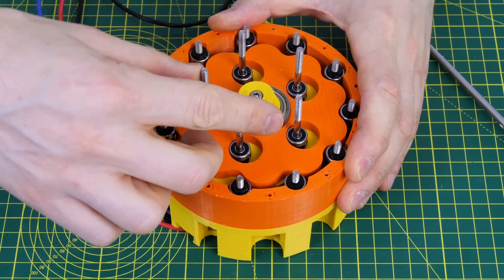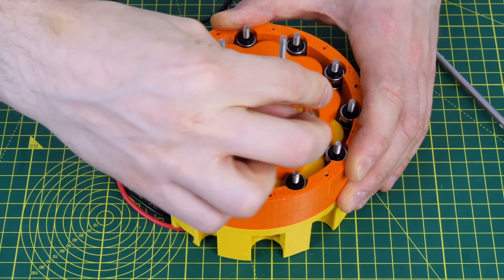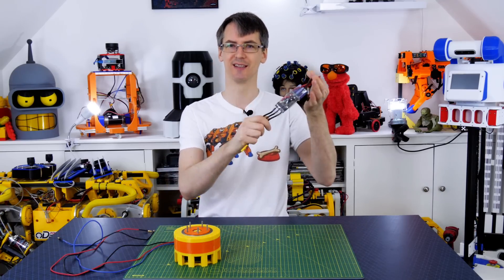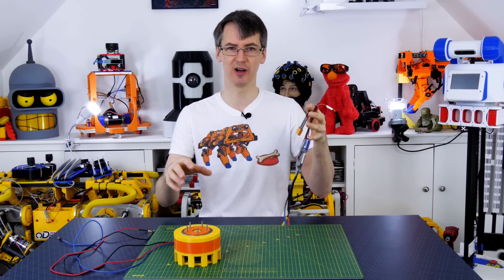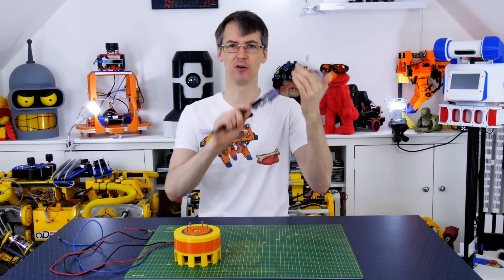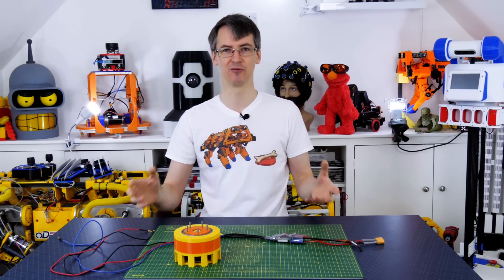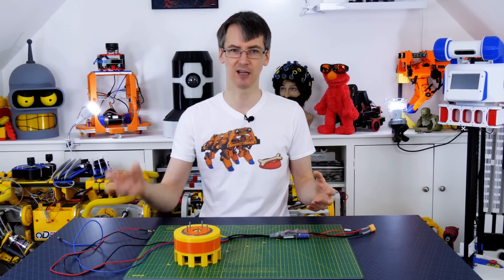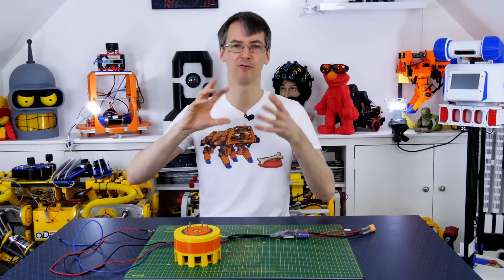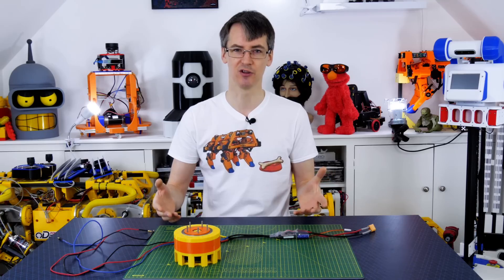I thought I should check inside to check there haven't been any issues, and everything just seems to be absolutely perfect — still all held together in one piece, so it's much better than version one. This motor driver is just using back EMF from the coils to work out motor position, which works fine on a skateboard going fast, but when you stall the motor it gets really confused. What we really need is an ODrive that uses an encoder on the motor so it knows accurately where the motor position and phases are, allowing it to handle holding power and everything else.